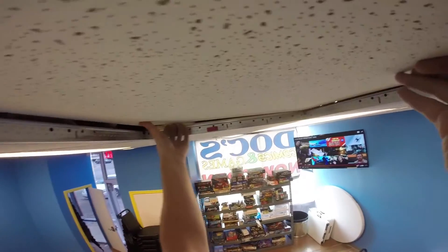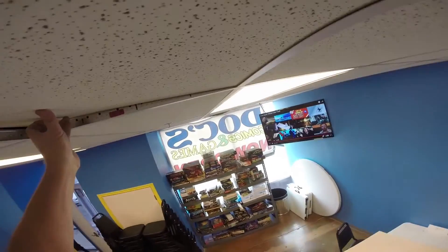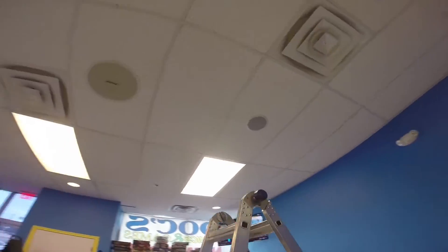Make sure the wire is up above the ceiling. We're going to close up this ceiling tile and put some of that fiberglass insulation back in place. I really should be wearing long sleeves and gloves — this fiberglass can be pretty itchy. Gently — these drop ceiling tiles can be fragile. Push the metal grid out of the way so the tile can drop into place, make sure there are no wires or insulation preventing it, and there we go — dropped into place. Looks good.